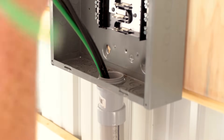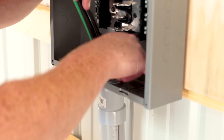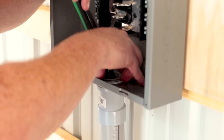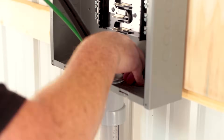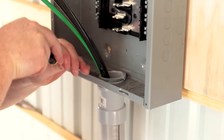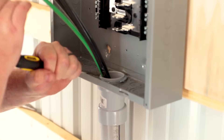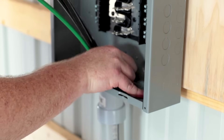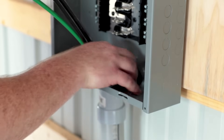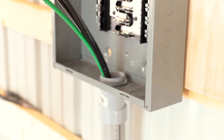Here's the nut that goes on top of the PVC before the other collar does. This will go here and then it will thread onto the pipe. One of the easiest ways to tighten this down is to put a screwdriver on it and tighten that down really good and tight. Make sure everything is secure and that we don't have a gap in there — just adjust to make sure everything fits the way it should. Now we've got a nice tight seal in there.